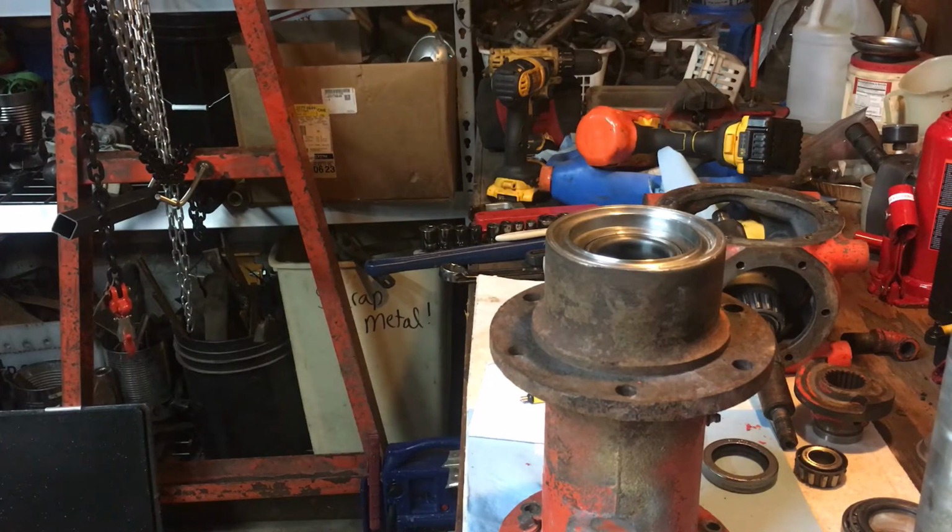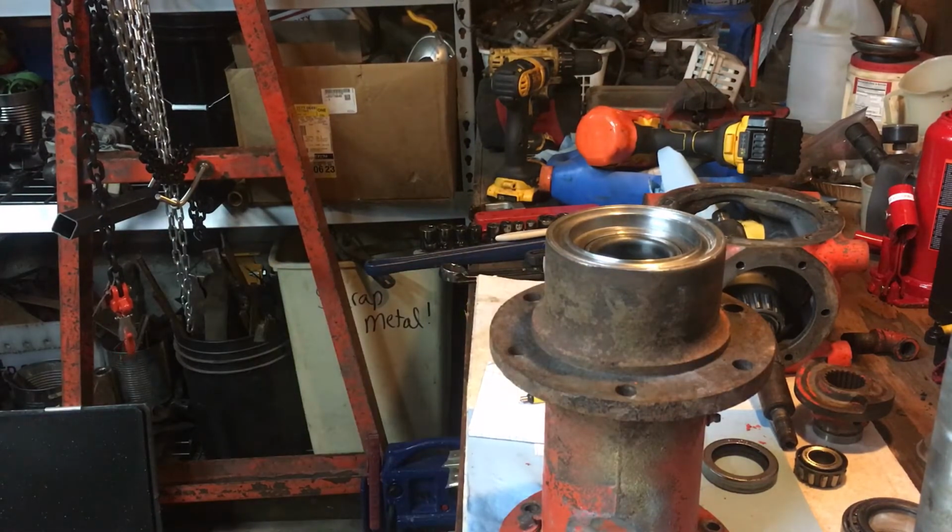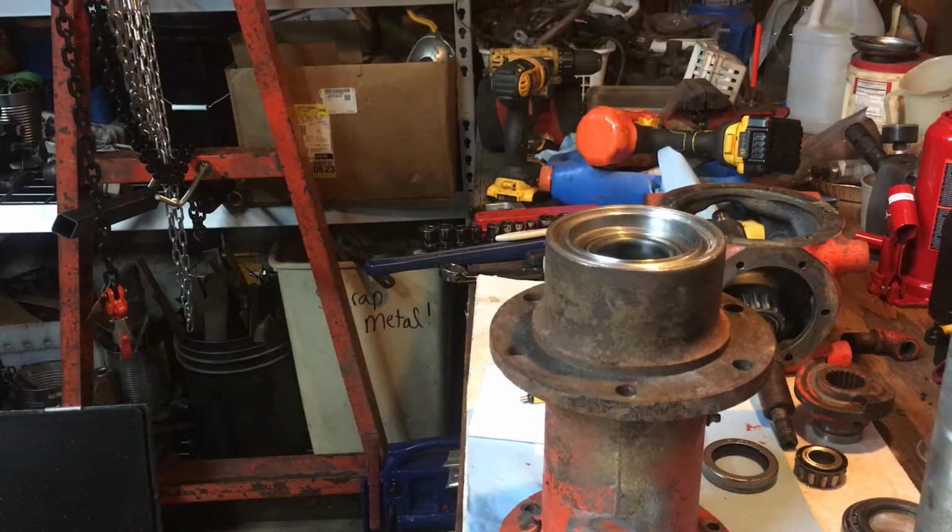It's going to be for overhead use, for picking up things. Like this thing together was probably 200 pounds. Picking things like that up. It is portable. I actually designed it to. I have an engine crane. When this is locked in place, you use the engine crane. It goes up high, and I've got an attachment that attaches at the top. And you roll it, and then you use the engine crane to lower it down onto 2 jack stands. You pull the top piece out. You slide the 2 A-frames together. They lock into place so they stand up without you having to hold it. And then you can load it onto your trailer and go.